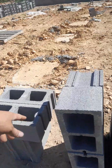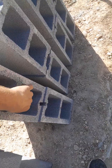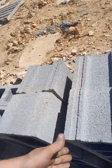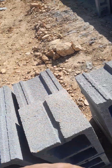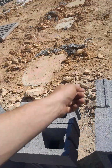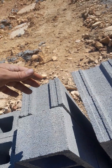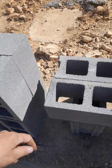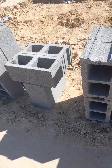This is how you do it right here — this is how I was taught. I stand the block up like this, fat side on the out. Some masons prefer their fat side on the inside and grab it like that. I like to have my tops lined up so I can butter down two at once, because a trowel holds enough mud to get two with each slice. A lot of masons go one-two on each one, but instead you can get two for one — it helps you go a little bit quicker.